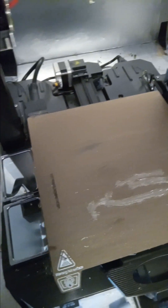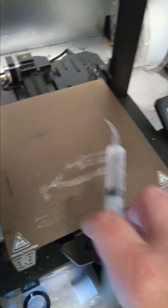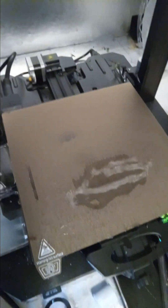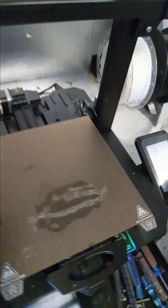I'm really only printing on this end of my printer today, so just a little bit of glue stick, then dilute it with some alcohol. I find that storing alcohol in a syringe is super convenient — I can just leave it on the table and it'll store indefinitely. Then I take a coffee filter because it's low lint, and I really dilute this until you can't even see it.